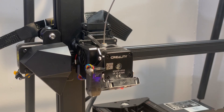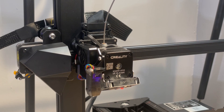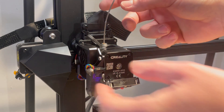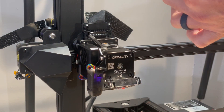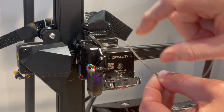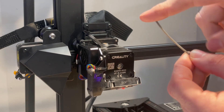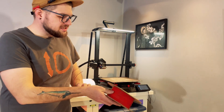One of my favorite benefits of a direct drive extruder means no more dealing with the fittings for Bowden tubes. Bowden tubes on Creality printers have been a consumable for me, wearing away at their connection points and often being a place where filament can clog or bind up. Additionally, filament changes are much, much easier. Instead of pushing through over a foot of Bowden tube to get to the hotend, you're wasting so much less filament — just a little bit comes off and you can reuse it.